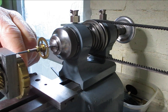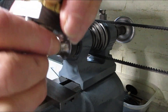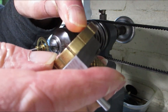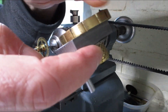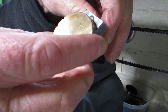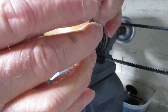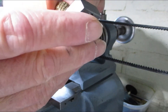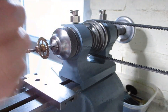I've already done this so I'm not doing it again, but that's all it is — just a home made tool. I drilled a load of holes all different sizes in the end of it and then just turned the outer edge off until half the hole protruded out. It's got adjustment up and down and that's just 5mm to go in the tail stock.